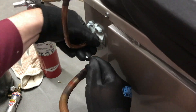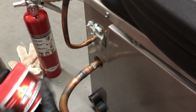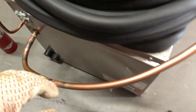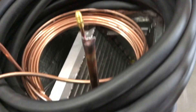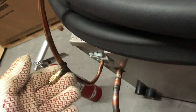In the meantime I'm going to put a little wet rag on. When I'm done I can just take that right off and stick it back in here and reuse it. So when you are hooking up the nitrogen to the system and starting to flow it, you just want to be thinking about: where am I putting it in, which direction is that going to go, and where is it coming out? In this situation it's a little different than what you typically see. I'm going in here to the suction line. The nitrogen is going to flow in and go in both directions — one is going to go through the coil and come out through one braze I still have to do, then through the line set and out to another braze. And at the same time it's flowing through this line set across this braze all the way through to the top braze here that I still need to seal up. You want to open one port, flow your nitrogen in, and have the Schrader removed from the other port so nitrogen can just flow out there.